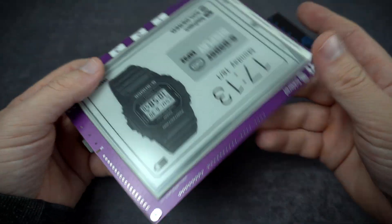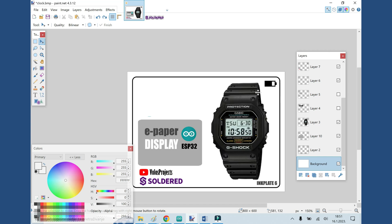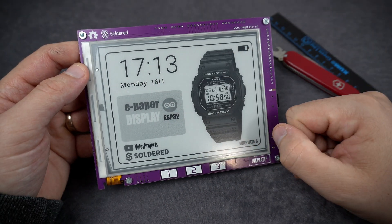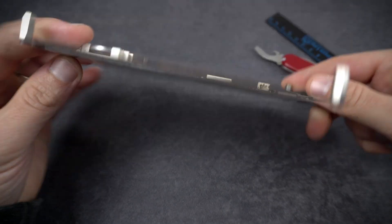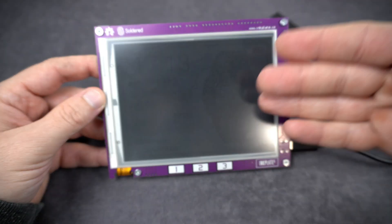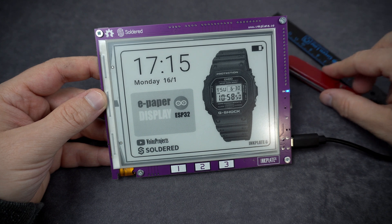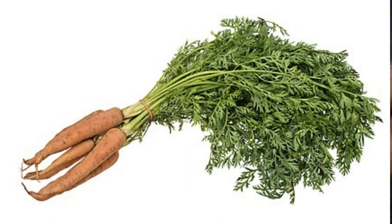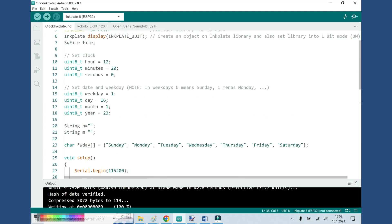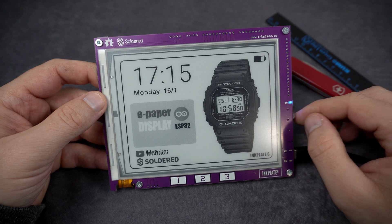I like this. I will probably use it as a clock and this is my example of a clock. I created this design in Paint.net, the image is saved on an SD card, and in this part of the screen I printed the current time and date, because this board has a built-in real time clock chip. And now you will say: you used an 800x600 display just to show time and you even added a watch image which doesn't make sense. And I will say yes I did — this is my channel, next time I will put a carrot here. You can download the code and image files — links are in the description. I made this to test the board and I think it looks good. Best part is that I made this very fast, maybe in less than an hour.